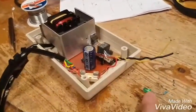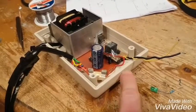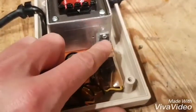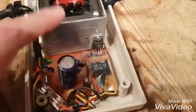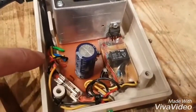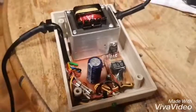And that should be it. So what should happen is if it's a safe voltage the green light should be on. If it goes wrong the green light will go out. So there we are — it's all wired in. A bit of thermal paste or grease on the regulator. Board's nice and solid, fuse is nice and solid, the wiring's all well insulated. We've got our LED here.